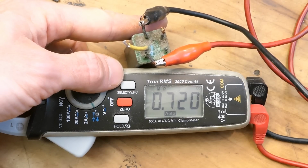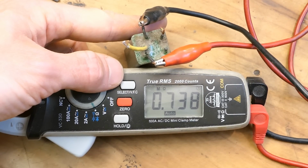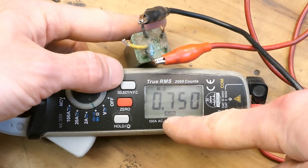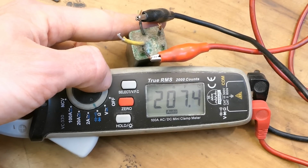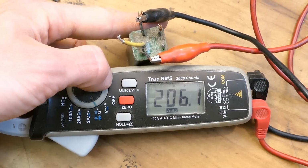And of course everybody was screaming at the monitor that I was testing the interference filter wrong, because in the circuit it was connected to the primary of the transformer. Now actually properly measuring the 100 nano capacitor, and it shows about 0.75 megaohms resistance, which is wrong, and the capacitance of it about 200 nano should be 100 nano, and I guess the capacitor just arced over internally.